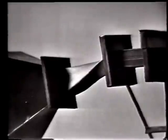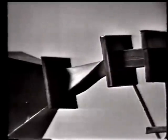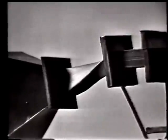We also saw that it was possible to twist a waveguide to change the polarity of the energy. But here too, the twist must cover at least 2 complete wavelengths to minimize reflections. Now, in such cases as rotating antennas or any place where motion or vibration are factors, flexible sections of waveguide are used to absorb the vibrations. Flexible waveguide is used where freedom of motion is essential.